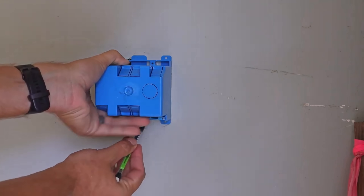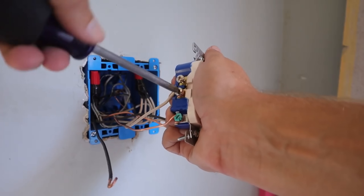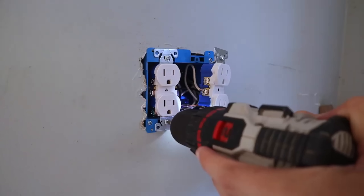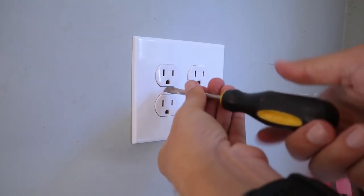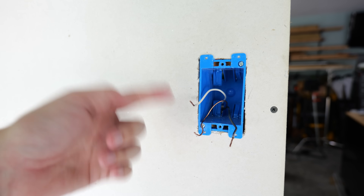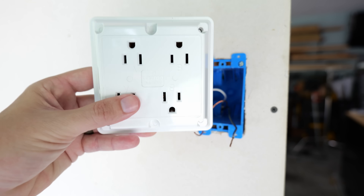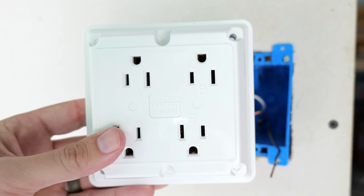Normally what I would have to do is take this box out, cut a larger hole, and then insert a double gang box to put in two receptacles, which also requires additional splice points — possible failure points. Whereas with this device, it all just gets connected to this one device, just like a single receptacle. Everything is contained underneath the terminal screws, which cuts down on possible errors or issues in the future.